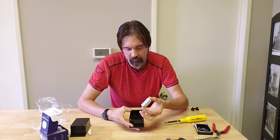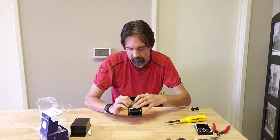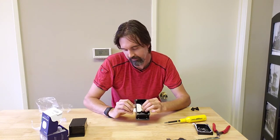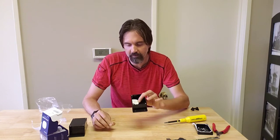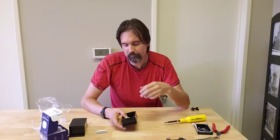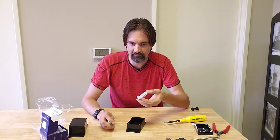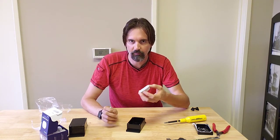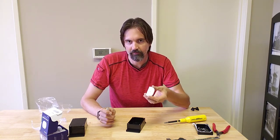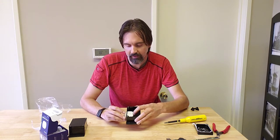I'm going to mount the SmartThings sensor inside the box along the wall so the magnet on the outside can trigger it. I'm using this to sense the open and close of a heavy-duty steel metal job box. Previously I tried putting sensors inside the job box, but the steel acts as a Faraday cage and blocks the signal — they only transmit when the box is open, causing constant 'offline' messages. Mounting outside keeps it in contact at all times.